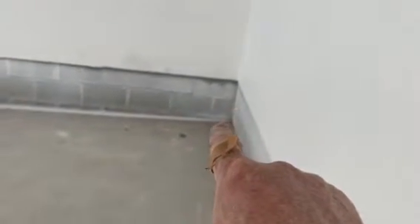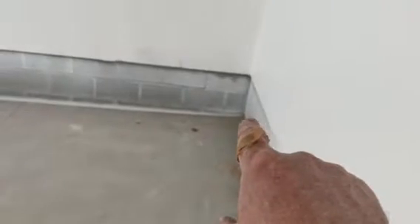On a garage, I'll just point out something else. Do you see the block wall here? You see how there's one, two and a very small piece of the third block, and as you go down you'll see more and more of it. That's not a fault of the laying of the concrete but rather it's so that water will run down, because we aren't allowed to put floor drains in our garages.